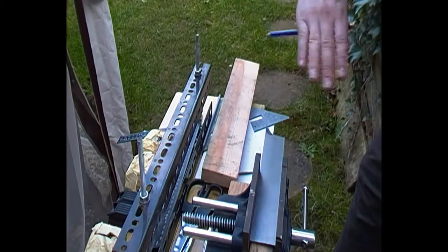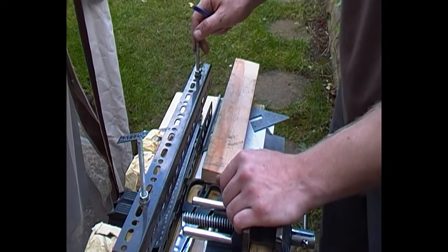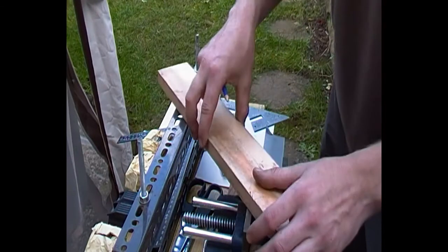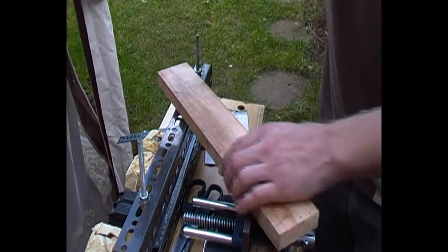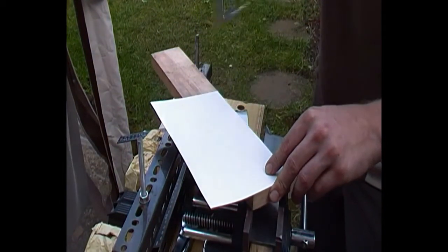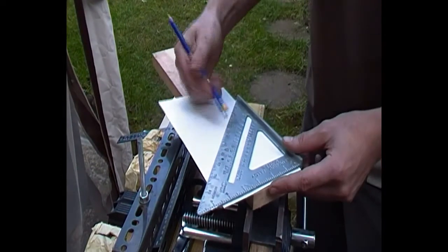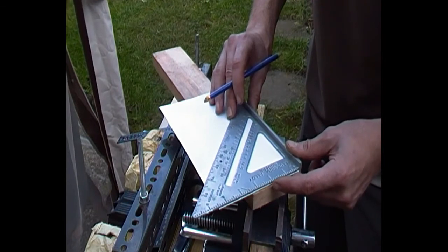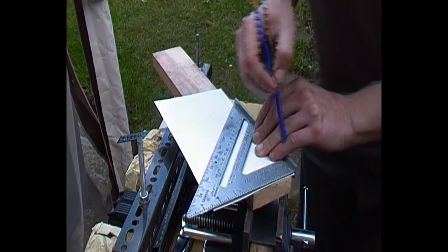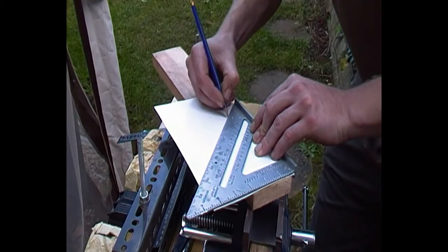If it's too low there's going to be too much angle and a lot of adjusting needed, and if it's too high it'll be too flat. You'll get a feel for roughly where the right angle is height-wise. Then you need to decide what angle you want the grind to be. For a 22-degree bevel you want 11 degrees on each side. The easiest way to set it to 11 degrees is to get a protractor and a piece of paper, or a roofing square — it has the angles marked on the outside edge, which are the only ones that matter here.